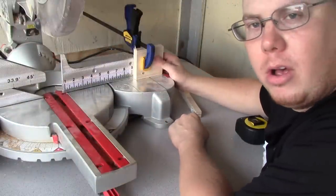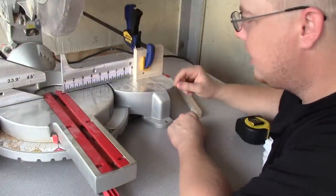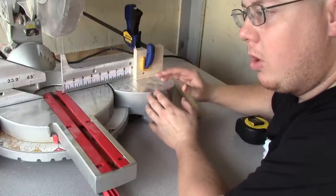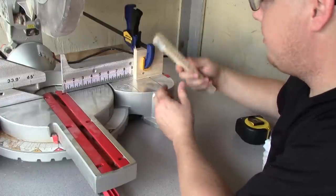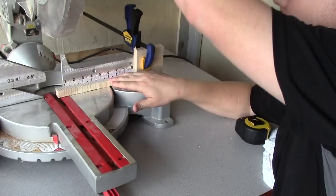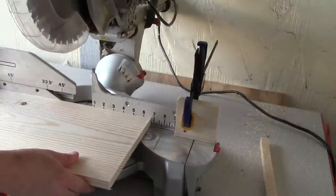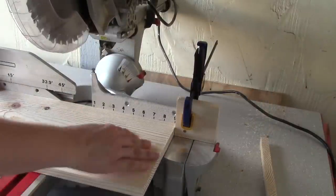You can see I set up a block here on my miter saw to cut these end boards for the toolbox. I'm using a 1x10, so it's almost 9.25 inches wide. We're going to make it square, so we're going to cut the same width as it is wide. I have just a simple little shave board I use as a guide, and I set up my gauge based on that. When you slide the board up here, you want to be careful that you don't bump it too hard and slide your block back — just go slowly.